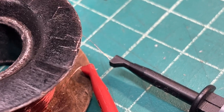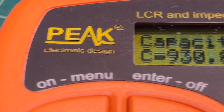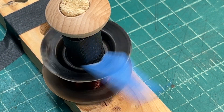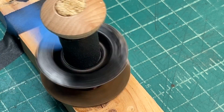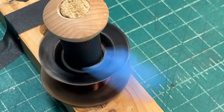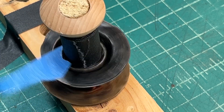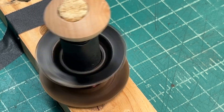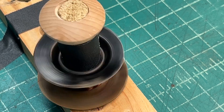I may unwind a few more turns, but no luck so far. As I'm removing the old winding, I found numerous breaks. Still unwinding at this point. I'm going to try to save the bobbin itself if I can — that being the coil former — so I don't have to construct a new one, assuming it's rigid enough. I'm just curious if there were additional breaks toward the center core of the winding. I've still got a ways to go.